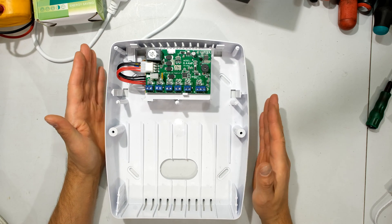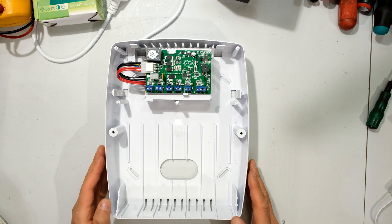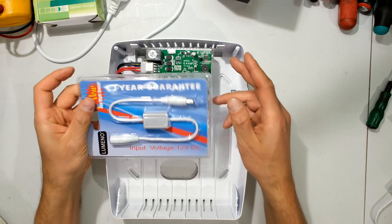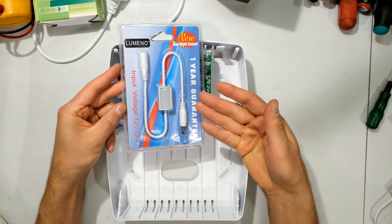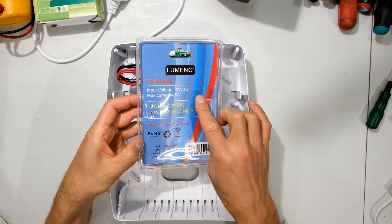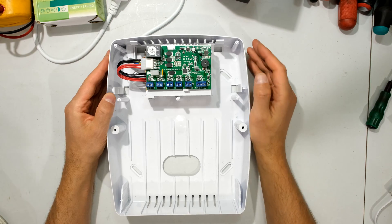The purpose of this is a backup light — I only need light when it is dark outside. That means I also need a day-night sensor to sense the ambient lighting so it can turn the light on or off. I'm going to be using something like this: it's a 12 volt day-night switch. The specifications say 12 volt DC, and it will open and close a circuit using 12 volts with a maximum current of 4.5 amps.